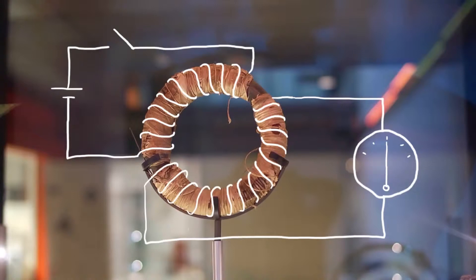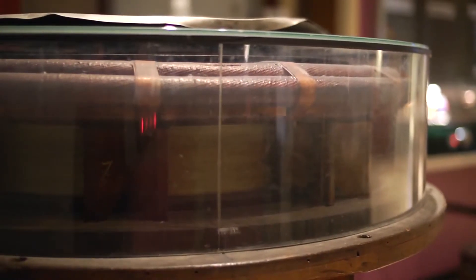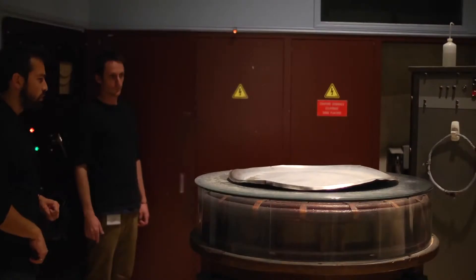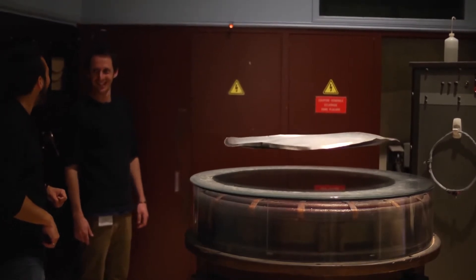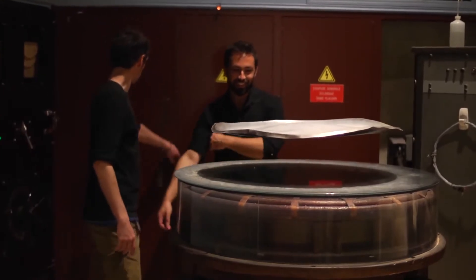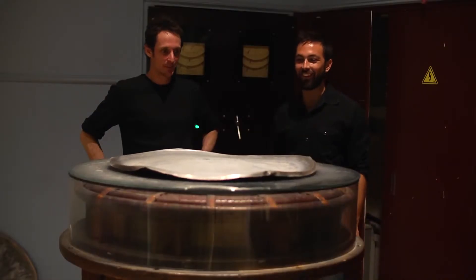He realized that current was induced in the second coil only when the magnetic field through it was changing. And if they hadn't been wrapped on the same ring, Faraday may have noticed that the two coils repel each other when the current is induced — due to the interaction of their magnetic fields. Which brings us back to this. Through the bottom coil, we are passing a huge electric current — 800 amps — which alternates in direction 900 times per second. This ensures there will always be a changing magnetic field above the coil. Instead of a second coil, we're using the aluminium plate. The changing magnetic field induces currents in the plate that create an opposing magnetic field, so it levitates.